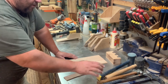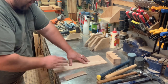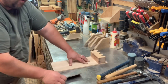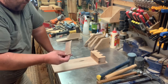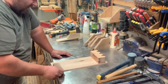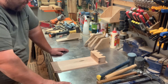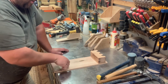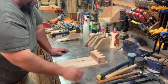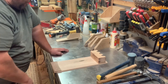For the framing hammer, finish hammer, and ball peen hammer, they're cut to the exact width of the headpiece here, which will go right about there. And then I've got this off-cut piece of scrap walnut, which has got some figure in it. I cut it to the exact width also, and I'm going to put it right down here on the bottom. So I'll glue this in place. I'm not going to worry about gluing the seam in between because it'll be held on from the back onto the main headpiece, and then I'll just need a French cleat for the back for that one.